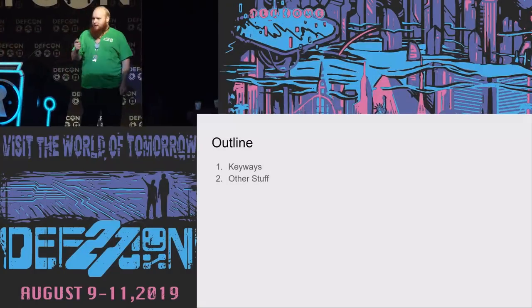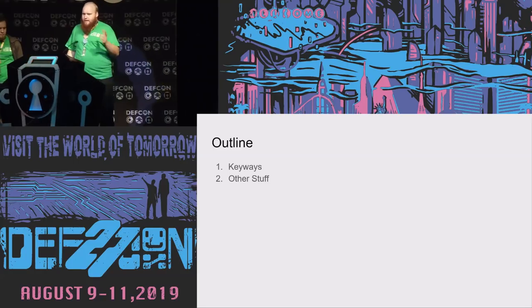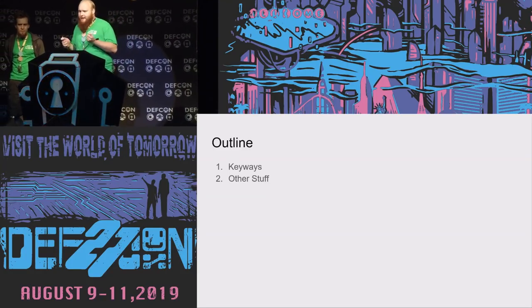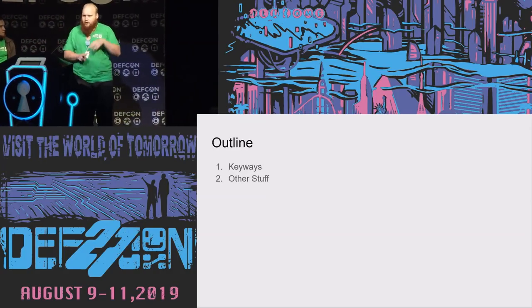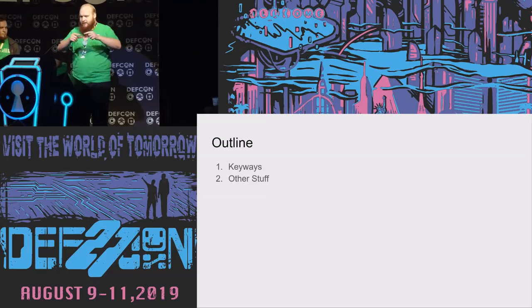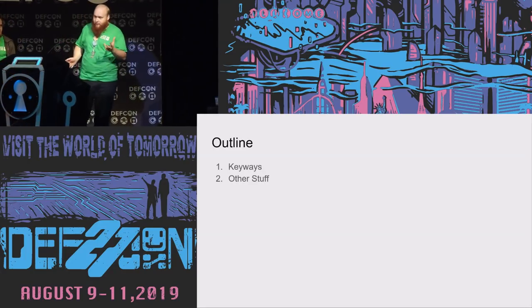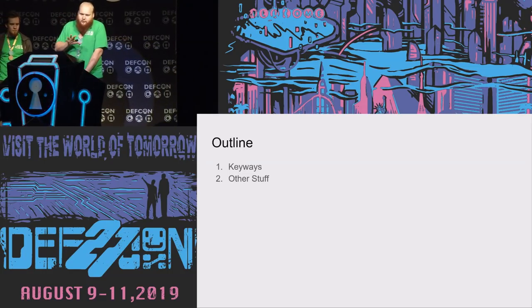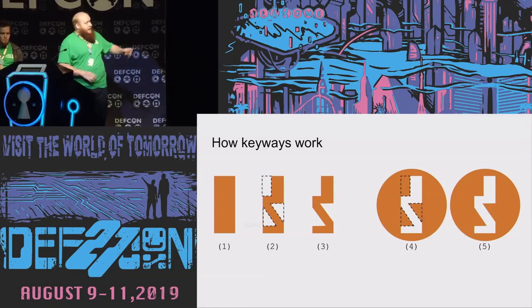When you take a restricted key into a locksmith, and the locksmith says, sorry, I can't cut this for you, the number one reason for that is going to be that the locksmith simply does not have the blank. In the two videos we showed before, profile cutting and code cutting, or origination of a key, we started with an uncut blank and we added the cuts into it that would then operate the lock. The most important part of a blank is what's called the keyway. That's the specific shape that that blank has.